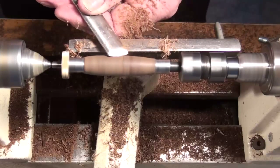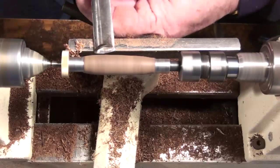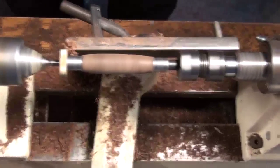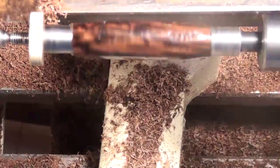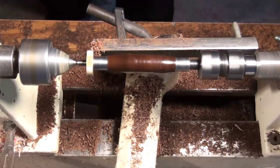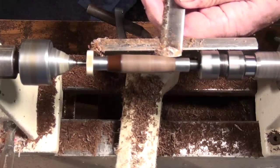So if you do get any of these blanks, I suggest that you drill them and then put the thin CA in there — shake it up and do it two or three times at maybe hour, hour-and-a-half intervals. Then let it sit for a day or two and come back and re-drill it, because the thin CA will be inside and the tube will not slide in and out. I've put CA on it a couple of times and squirted it with accelerator from time to time, basically trying to give this as much possibility as I can of staying together. The CA will hold it together, and as you turn it, it isn't all that hard, although it is dense. Once the CA is on it, it does require a sharp tool, so you probably want to sharpen your tools from time to time — particularly after you've squirted it with accelerator. That's a good time to let the whole thing dry, go sharpen a tool quickly, then come back and take a couple more passes.